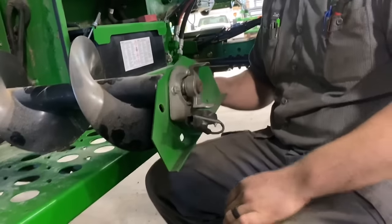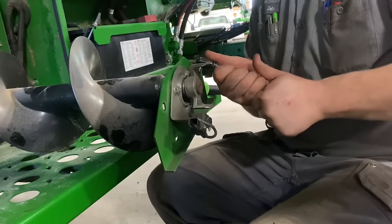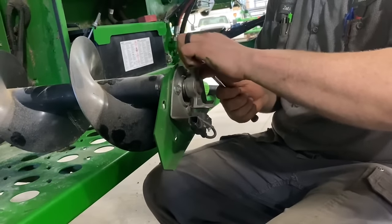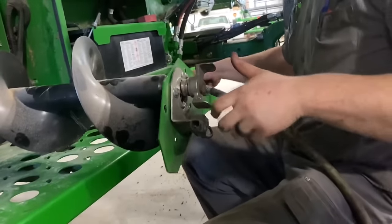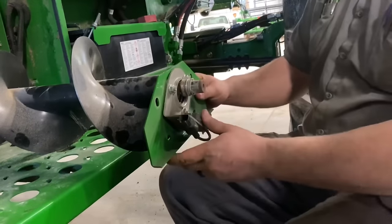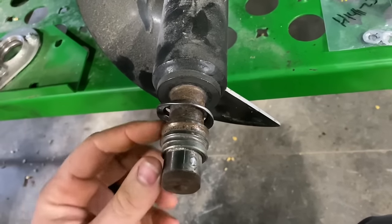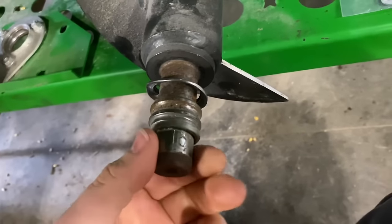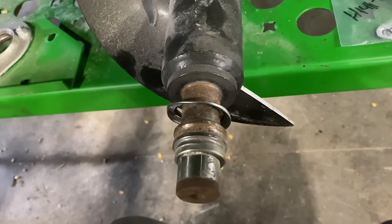Now we're gonna tackle this mess. Our tone wheels, also our lock collar for our bearing. 5mm Allen there. That's convenient. Okay, now we're just left with this inner race here that we got to get off, but I'm going to clean this shaft up and smooth out this set screw mark here, soak it down with some penetrant oil, and see if we can't air hammer this guy off of here.